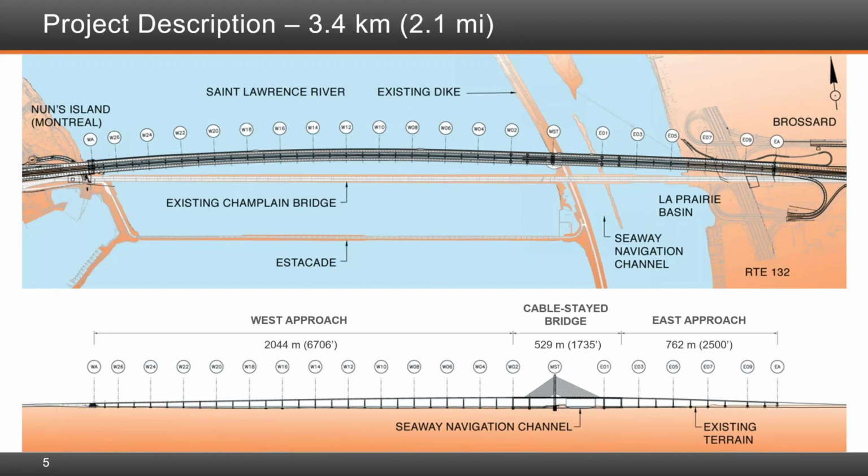Okay, thank you. The next question is, was it not necessary to use cross ties between towers above the bow tie? No, it was not necessary, but we definitely looked at that during construction to make sure that the tuning forks of the tower are actually stable and they don't vibrate too much. I could add to that. We designed it to the 1 in 10,000 year wind. As we start cranking up the wind even higher, there is some vibration that starts at the top of the tower. So that's a very good question, and it was looked at quite carefully.